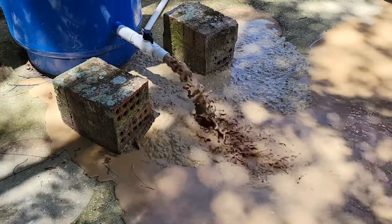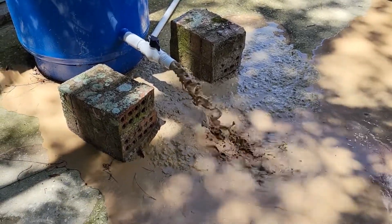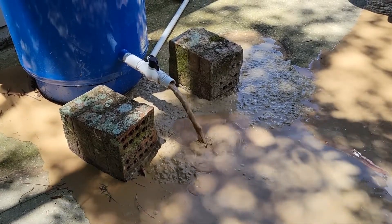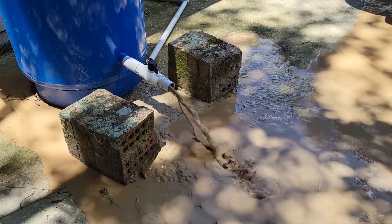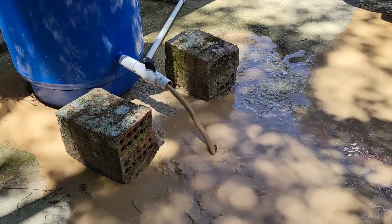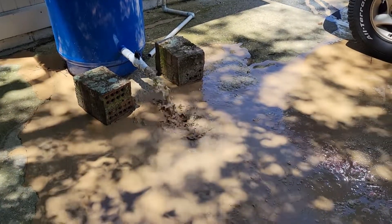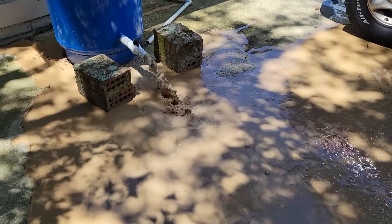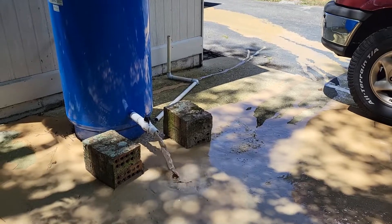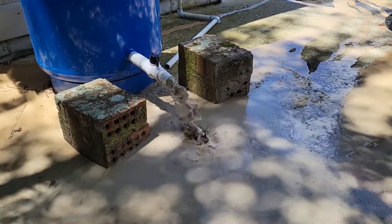It's not big enough — the casing is failing. Normally most systems don't need a retention tank at all, but if you're drawing in any sand you have to have it and purge it like once a month. But even a once-a-month purge is really only like a plate full of sand. The casing failed — it was going okay for a while and then suddenly it started drawing in sand and going down the driveway.